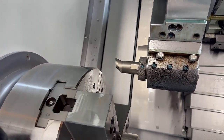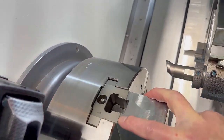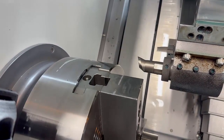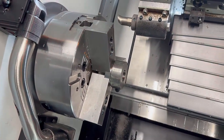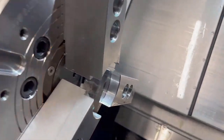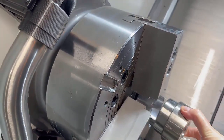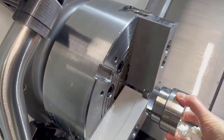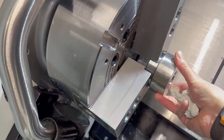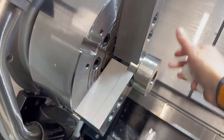So that's good enough to tell that these jaws are in about the right place. And you can see on the edge there where the level is level with that jaw carrier. That's our final jaw. You can see it's well past the part, so there's plenty of movement there — that's it open, plenty of movement there. Hold your part nice and clean, close, and that's got it.